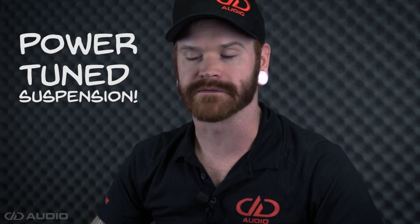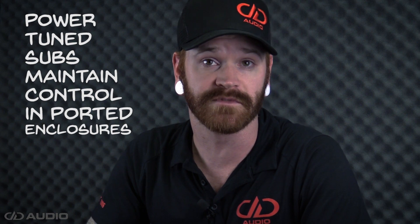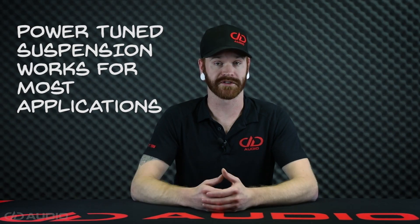Moving on — Power Tune suspension. It's a little stiffer. Anyone who has used a DD subwoofer is probably familiar with our Power Tune, or standard suspension, as this level of compliance has been a hallmark of the DD subwoofer since the 90s. The low compliance of the Power Tune spiders allows the sub to maintain a great deal of control in the large ported enclosures these subs are intended to operate in. Having a lower compliance driver means the driver relies less on the air spring effect of the enclosure to maintain control, in turn allowing the use of a larger enclosure that produces more bass. When your average listener wants some bump in the trunk — not only do they want it to sound good, but they certainly want it to be loud. And that's where Power Tune suspension comes in.